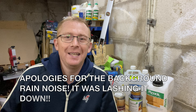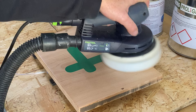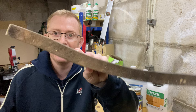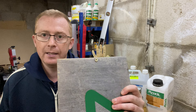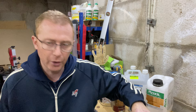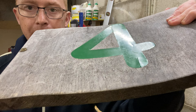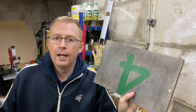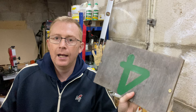The control piece was always going to be an interesting part of the experiment. All I did once the resin had fully cured was sand it down and polish it up, applying no finish whatsoever. Some folks say wood grows outdoors so why apply a finish — well, here's why. After four months, it has warped considerably. It managed to shear a torque screw completely through the cupping. And if we look closer at the resin, you can see cracks there and here, obviously as a result of the movement of the wood. So the control piece clearly shows you need to do something to protect both the wood and the resin.